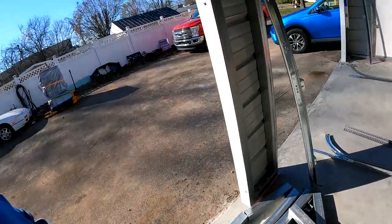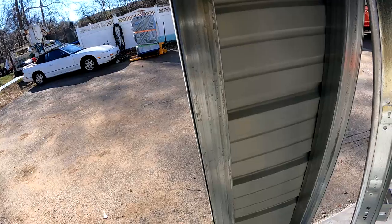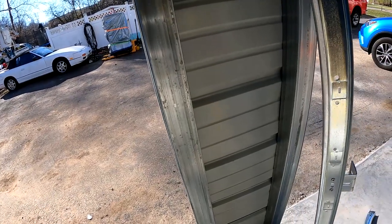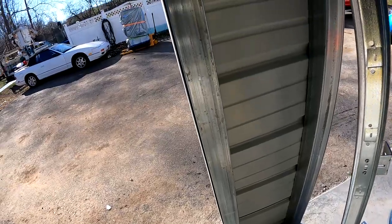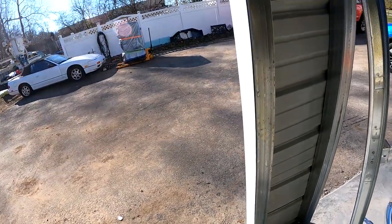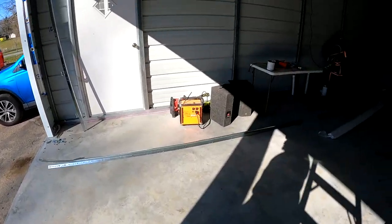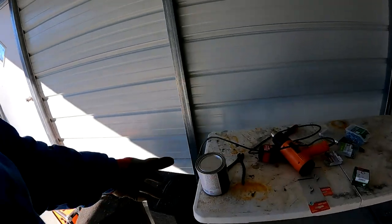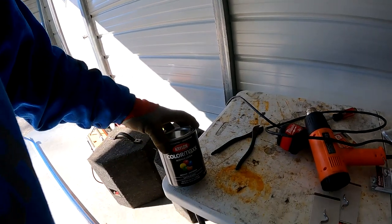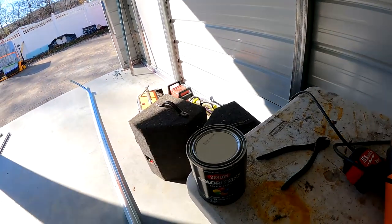You can't go with your weather protected lumber because it will corrode the frame of this building because it's steel, and the stuff they use to treat the wood is corrosive. So I had to go with untreated, so I'm gonna have to paint it first. So even though it's cold today, I'm gonna be doing some painting. I'm gonna paint those 2x6s, some cheap paint, trying to protect them from any water that infiltrates and make them look a little nicer.